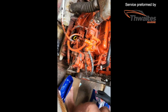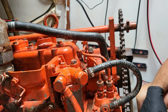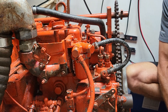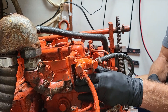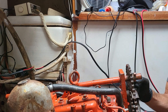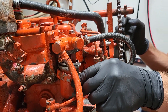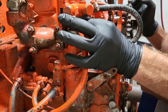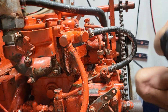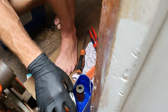If you have a big flat screwdriver, we'll change this fuel filter. They go up pretty tight and often a screwdriver across there does a good job. This is the secondary filter — this one's the one that's under pressure from the fuel lift pump. Once you get that down, this is on an O-ring, just give it a pull and it'll drop down into the bowl. The filter itself will drop down into the bowl. Get rid of that one, which has been there for a very long time, and give it a little wipe out.